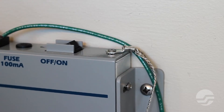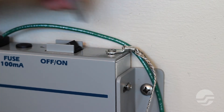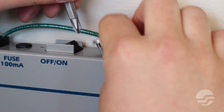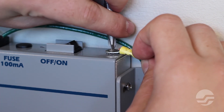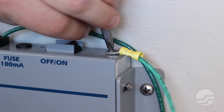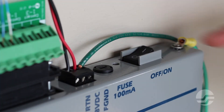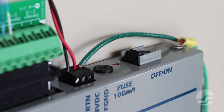The UM260 is equipped with a 12 inch by 1/4 inch frame ground strap that is secured to the chassis on one end using a number 10 terminal and lock washers. In a wall mount situation, you may need to modify the number 10 terminal with a longer conductor to reach the central office earth ground. With the power connector block securely inserted into the monitor, flip the power supply switch on top of the UM260 to the on position. In a few seconds, the UM260's power supply LED will light, indicating that the unit is properly powered.